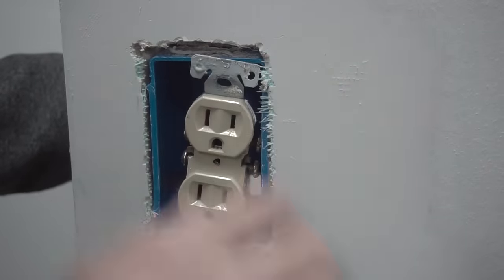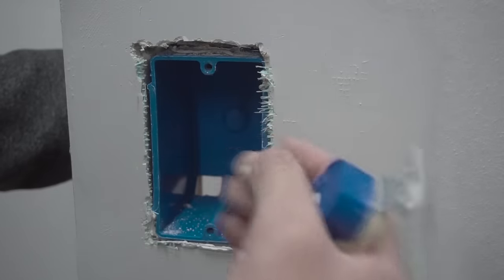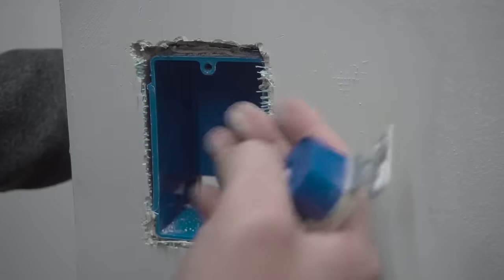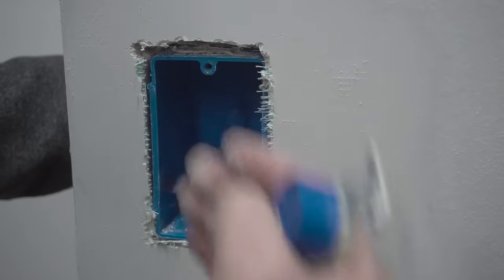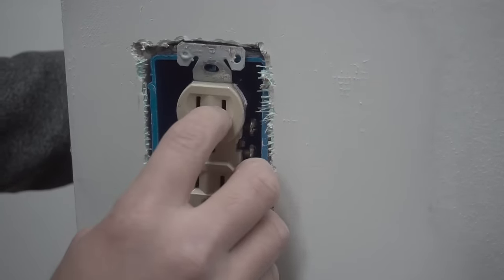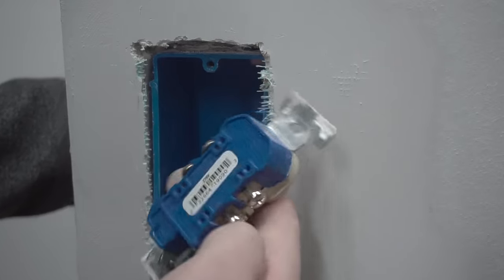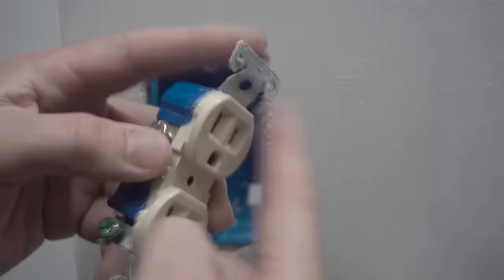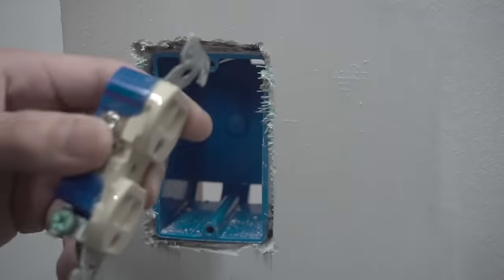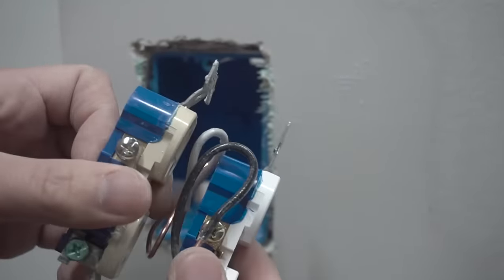So that will make it have a sunken look. With your J-Box not leveled — with your drywall being proud of the J-Box, meaning it's over the J-Box cover itself — this is going to be tearing up the drywall on the side. If you look at your outlet right here, these little plates right here — and if this is a very bad one, it's already bent due to the fact that it got pushed in, and that's what's causing the sinking. It's supposed to be straight like that.